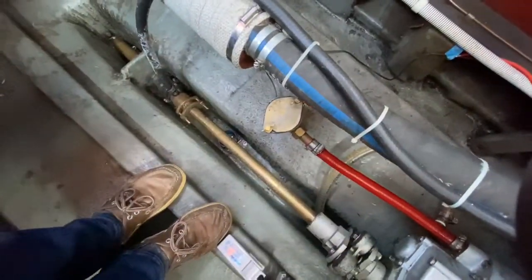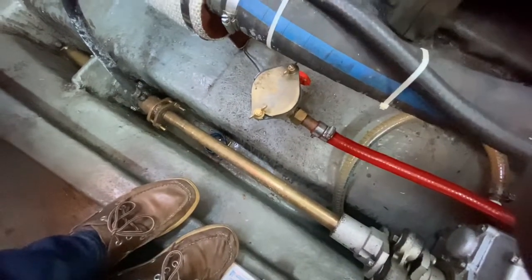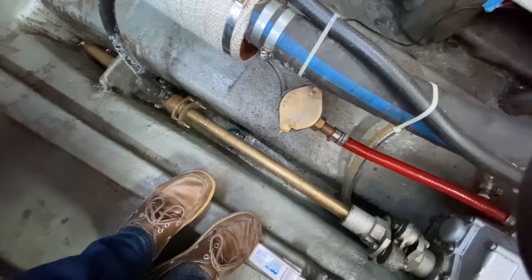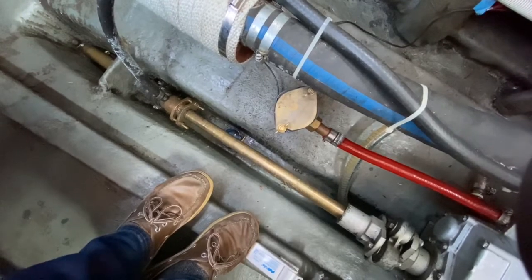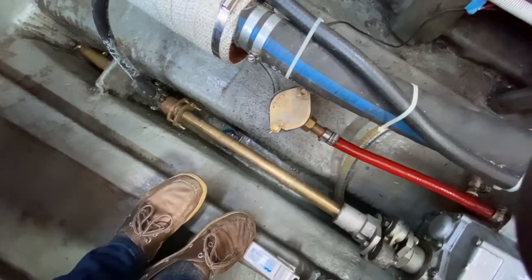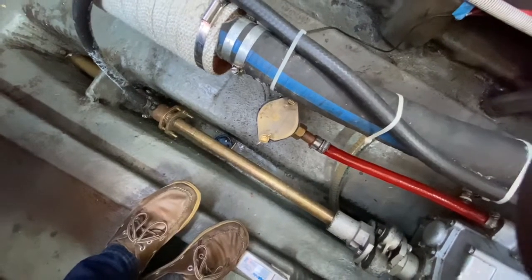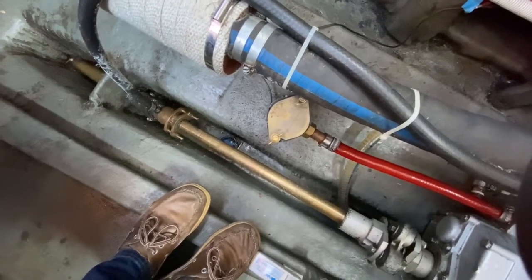This is a really important part of the boat. This thing here is your weed filter. I talked a little while ago about cooling water getting sucked in around the engine and pumped out so that you don't get any weed and stuff going in through the cooling system — there is a filter to get rid of all that. It's vital that it is checked on a regular basis, because it could prevent easy water flow. It's one of the first things that makes your engine overheat and it's actually probably one of the most common things we have problems with.